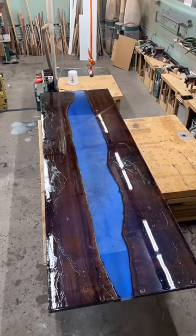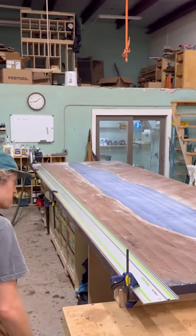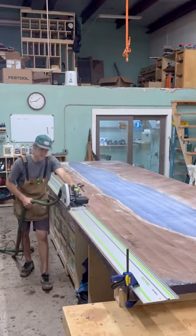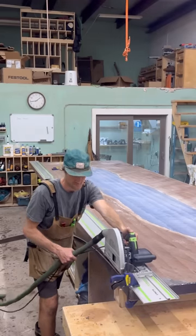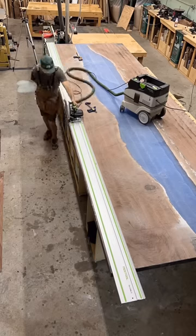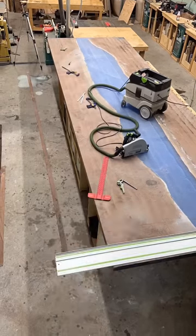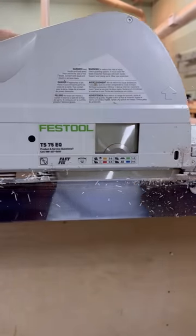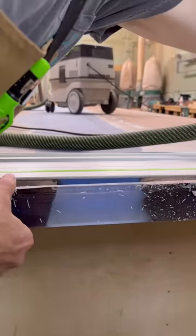What I did not show was flattening it on the slab miser again. Back to cleaning up the edges and squaring off the ends. I typically make my tables a few inches larger on the width and the length just so you can come back, get it out of the form, and make sure that you're able to cut it down to the dimensions that you're going for.